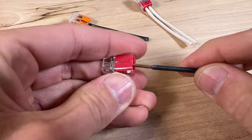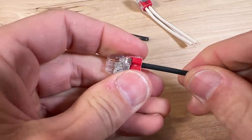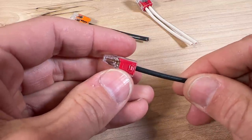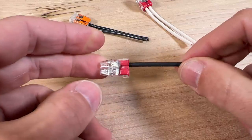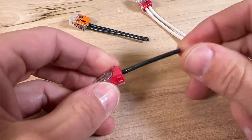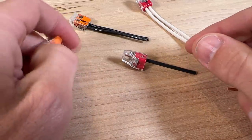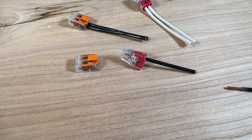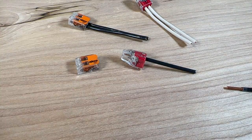With the push-in connector, we strip the wire and push it through into the housing — now it's securely held. With the clear housing we can see the wire is fully in place. But if anything changes and we need to remove the wire, the problem is we're going to have to cut back some of the wire because these are one-and-done. If you have short wires, that could be a real issue. So the first reason is simply reusability — the 221 lever nuts are extremely handy, especially for DIYers doing a few electrical projects a year who need flexibility to do and undo their work.